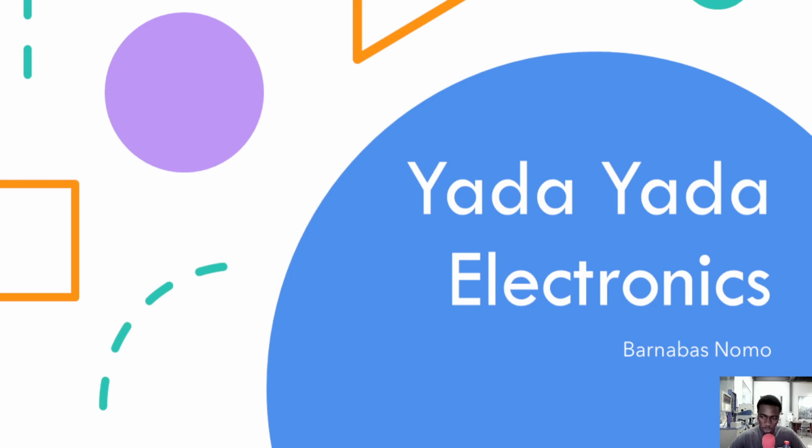Today, we're going to be building an interesting project. It's quite mainstream, and I think it's one of the early beginner projects that people getting started with the Arduino work on. And that's a way to take a few digital I/O lines and control 16 LEDs with it. So we're going to have an array of 16 LEDs coupled with two 8-bit shift registers, and we're going to design the schematics.